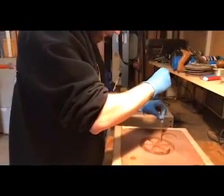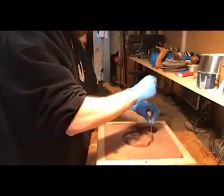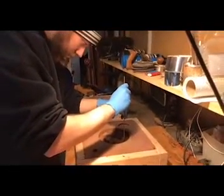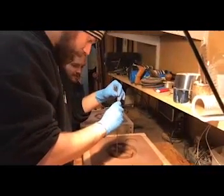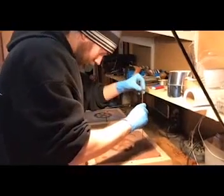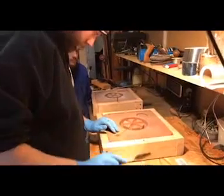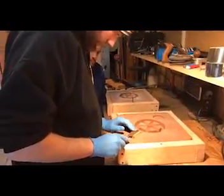What are you using to do that? It's a brass tube. I couldn't find the rod I used to have — tube's probably better anyways. So you just kind of got a feel for this from your last castings. Yeah, it worked last time. You all saw that in my video from Hack Pittsburgh — we showed you the final piece from the last design. It didn't flow well, so that's why Alex changed it to this. And hopefully this gives us better flow. He's also going to make the metal hotter so that it has more fluidity.